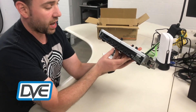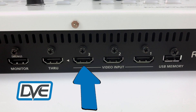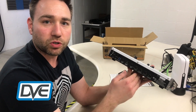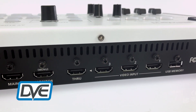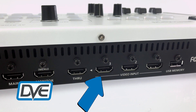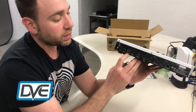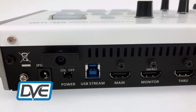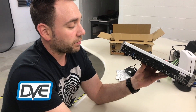On the back, you're gonna have input one, two, and three. There are scalers on each of the HDMI inputs, so you can have different resolutions coming in and it'll match them up for you. Especially useful for gamers having gameplay coming in on the third HDMI input — there's no latency on the through. You're also going to have a USB out so you can plug it into a Mac or PC, and your computer will see it as a web camera so you can stream live from there.